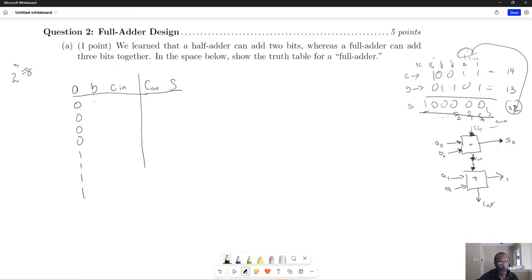We fill in all eight rows going from zero all the way up to seven, covering all eight possibilities. We want to account for: if we're adding two bits and there is a carry in, what would that be? When we're adding those three bits all as zero, we have a sum of zero and a carry out of zero.